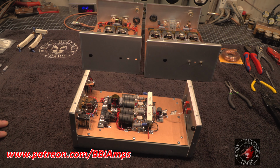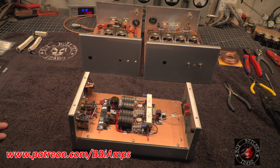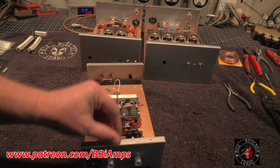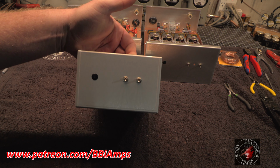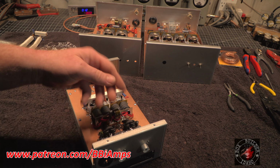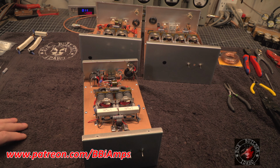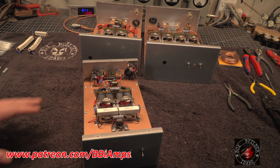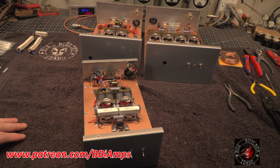Well, this is done. Bias is added. Input, output, combiner, capacitance is all added. On, off, sideband relay, coax connectors, remotes all tied in. Output tuning networks all installed. The only thing it's missing is some vinyl on the front, some power wires out the back, and some vinyl on the back, a fan, a lid, and a fan guard. So we're gonna set this puppy aside. I've gotta go wrap up these other two boxes and get them to this same position. But the masterclass is 90% done, boys and girls.